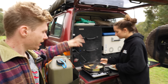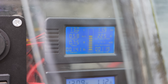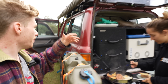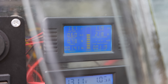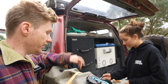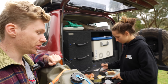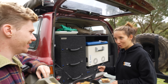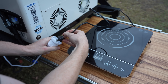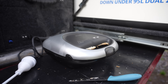With 120 amp hours lithium, we did two coffees and eggs and bacon no dramas. When I shut the system off we still had about 13 volts — I think that's about 30-40% of battery left. According to the charts, we only used 11.7 amp hours to cook the bacon and eggs, and 5 amp hours for the two coffees. With a 120-110 amp hour battery we should still have plenty of juice left. But it cut off again — voltage getting too low.